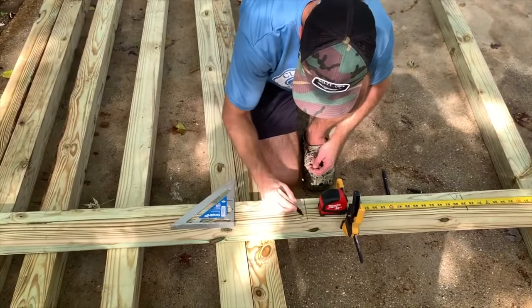So if we pull away the siding, here's a look at the wall framing for the window's rough opening. The anatomy of a shed window's rough opening framing consists of things like king studs, cripple studs, the window header, etc. So feel free to pause the video if some of this terminology is new to you. But what I really want to spend some time on is the actual rough opening dimensions for your shed window.